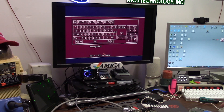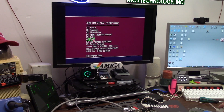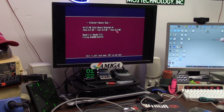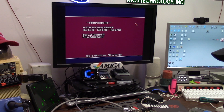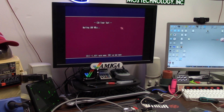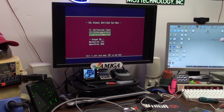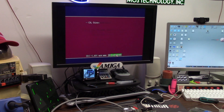Keyboard — don't have one, we'll put that together shortly. Video RGB — clear. Memory — oh! Memory test: Hall Memory, this is motherboard RAM, let's hope she works. These are 16 64Kx1 chips. Oh, we're rolling through it. Check CIAs, timers — we're NTSC so sometimes we run fast. Nope, we're good. Battery-backed clock — no. Peripheral ports — not going to check because I don't have the dongle.